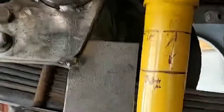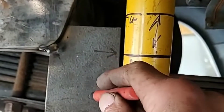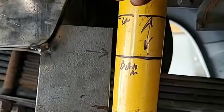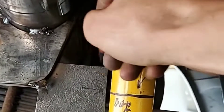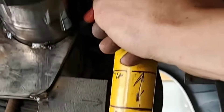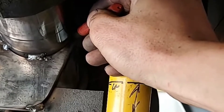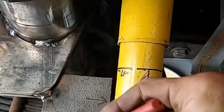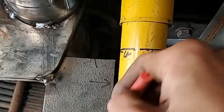For my idea on the plate — because of how much lower it dropped — this is kind of too small, so I'm going to tie another plate in up at the top, fill this void, and then go from the top of my axle bracket through everything and kind of taper down. So I'll go from the top of the axle bracket through all of it.